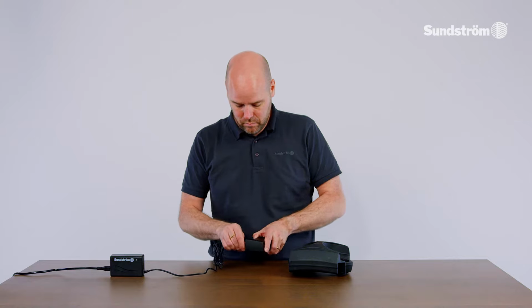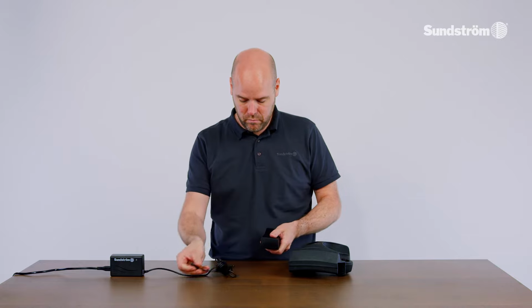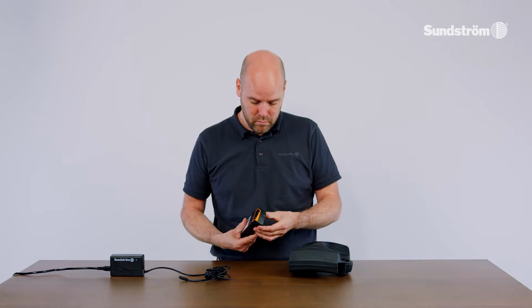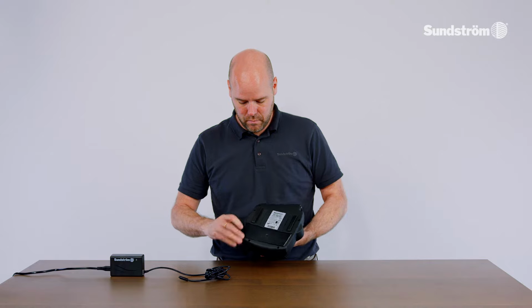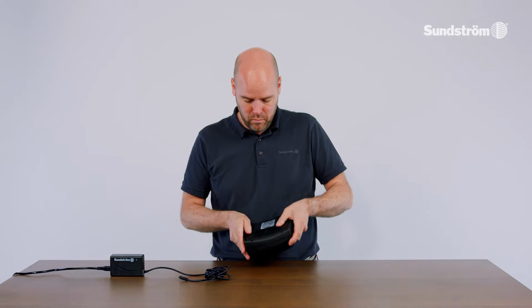Store the battery at room temperature. Repeat charging after 6 to 8 weeks for as long as the storage continues. Any dirt of the battery gasket is wiped off with a dry cloth. Relubricate the gasket with Vaseline for easier mounting.